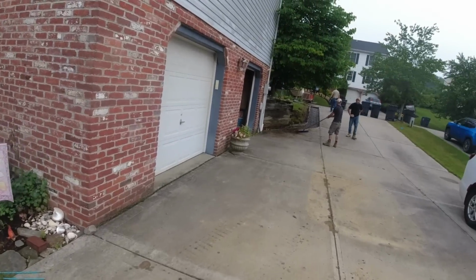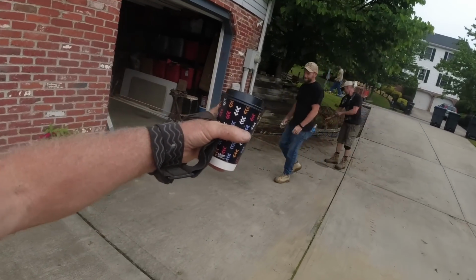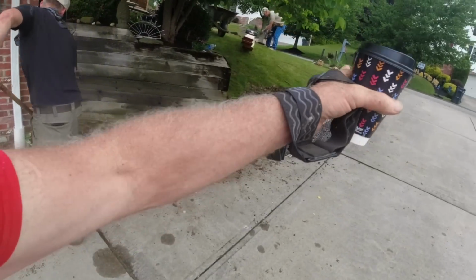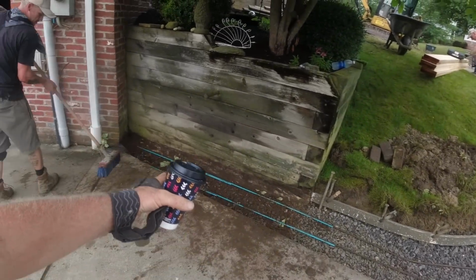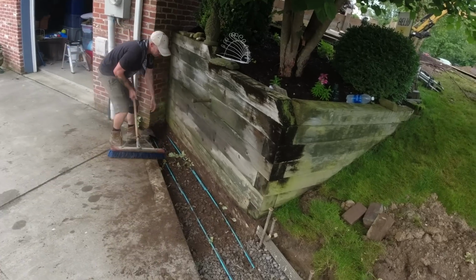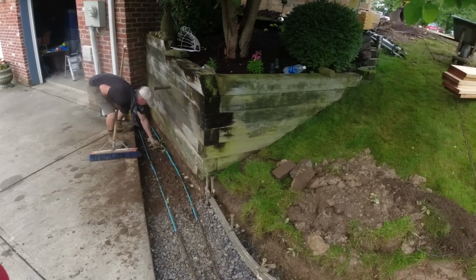One little change up here, the guys just finished up with. There was a planter bed here yesterday, and it is gone today. We're going to take this concrete extension all the way to the house and it'll just be a lot cleaner in there. We'll put expansion joint against the tie wall and keep some separation.